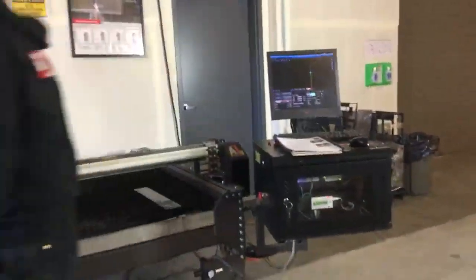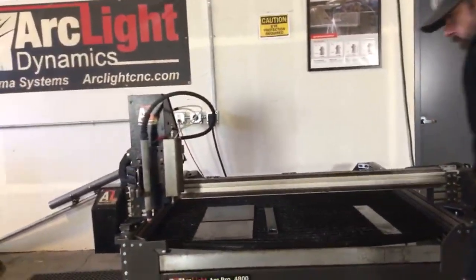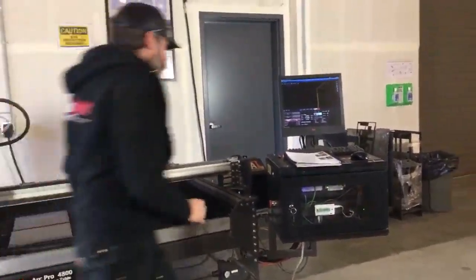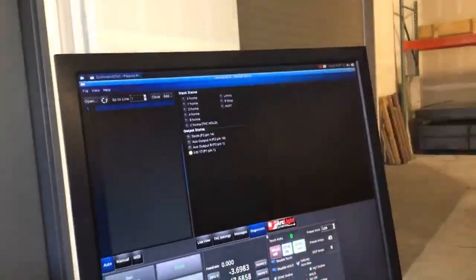That sounded like a switch problem. I'm going to do a quick diagnosis on that. So this gives me a great opportunity to show you guys the diagnostics screen. This diagnostics button right here is going to be one of the first places that you check when you hook your system up. This diagnostics screen shows us the input status lights. You'll be able to see the switch light up here, and the switch that's acting up is this A switch right over here.